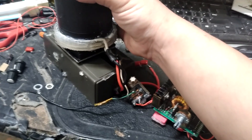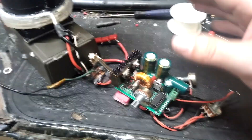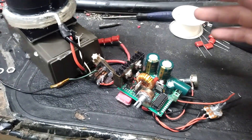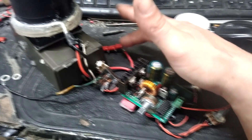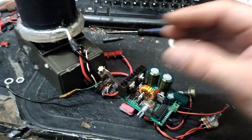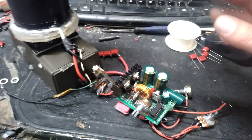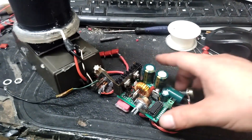They're 35 volt and I've got 6,600 microfarad worth on there. After replacing the MMC and getting the primary tuned about however I want it, it seems to give me about the longest discharges from 30 volts or so. I can fine tune this primary MMC to get higher output at lower voltages, but the plan was to get the longest breakout at the max voltage I could feed it, which is about 30 volts.